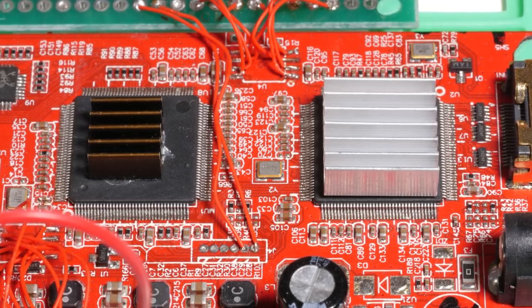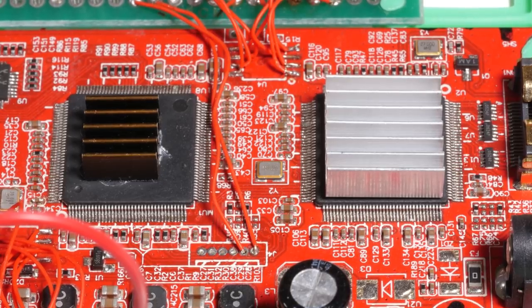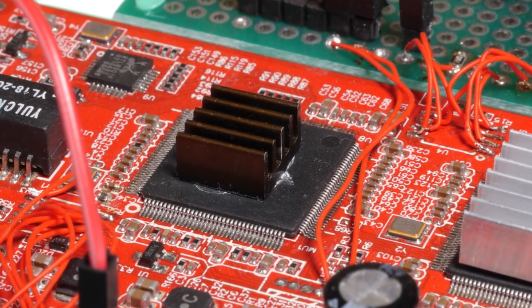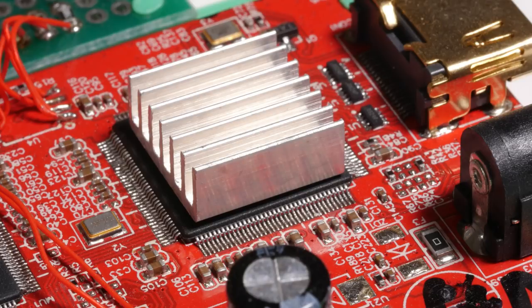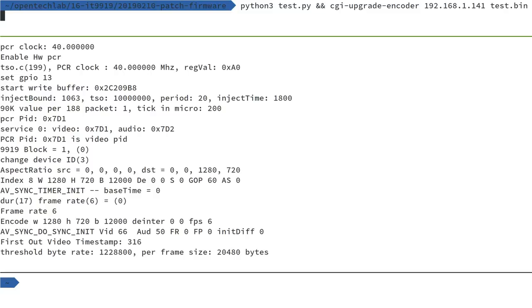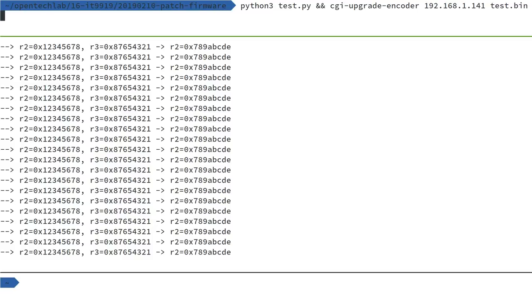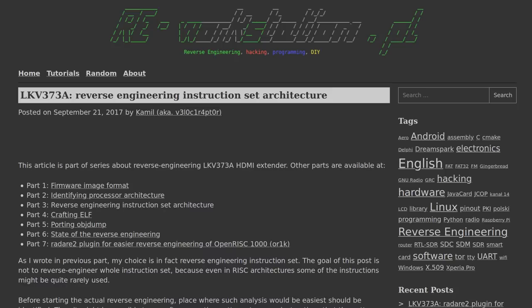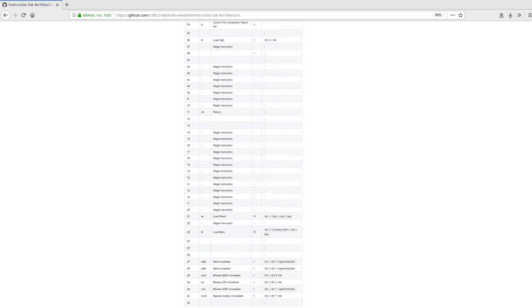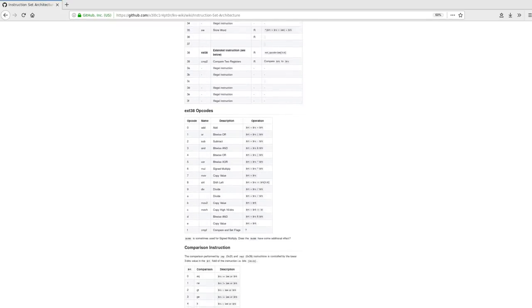You might remember from the previous video there are two chips on the board, MU1 and U2, and both have had their markings burned off. MU1 seems to be in charge but we don't have much information about it. U2 is an IT9919 made by ITE. We don't have much information beyond a very simple datasheet that was leaked, but I was able to gain very basic code execution on this chip by modifying the upgrader software, and based on some interesting blog posts by Velociraptor I was able to make progress reverse engineering the instruction set and writing simple programs.